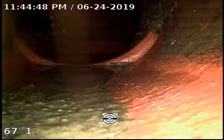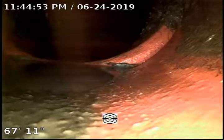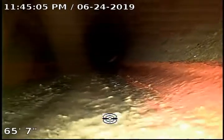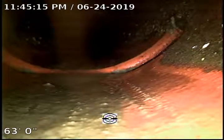As you can see, it's the original clay piping — this is the 6-inch line. We do have a couple of offset sections, as you can see right here; this section is kind of offset at its place. It's primarily an age issue. There's a little bit of water accumulating, but nothing really serious. We don't see any roots coming through the joints. Check the records to see if the line has been hydro-jetted previously or maintained. But as of right now, we don't see any major issues with the line itself, except for those couple of offset sections.